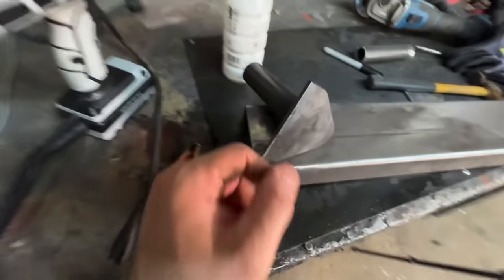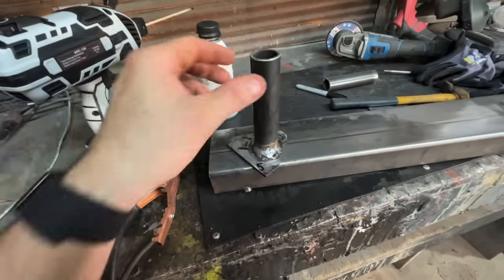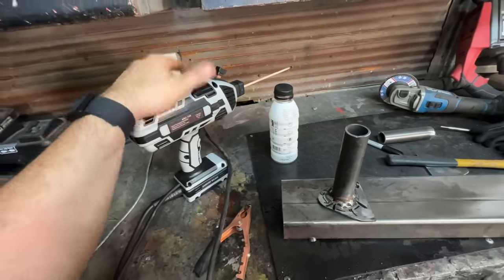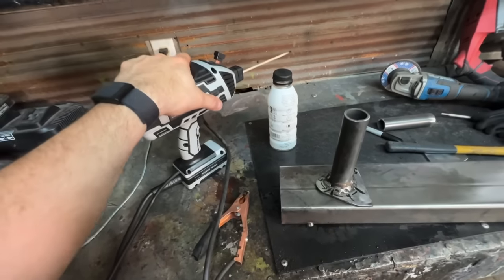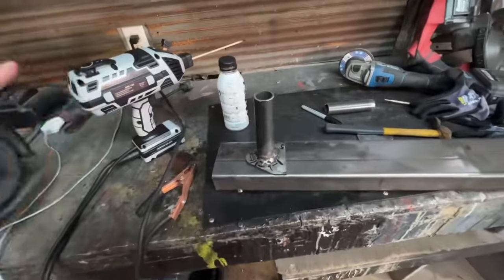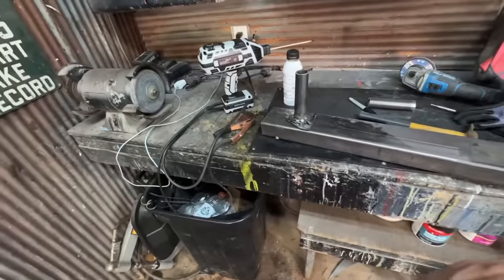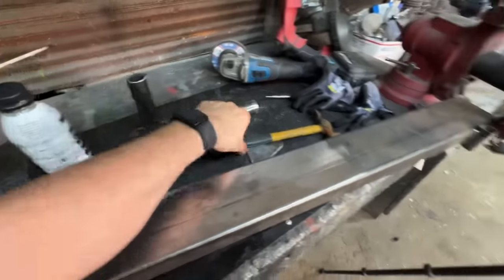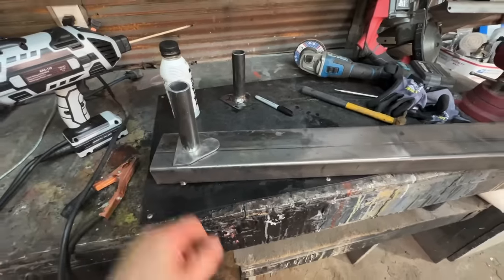That's 100% solid — it's not going anywhere. We also got really good heat. This is 3/16 inch plate — might be quarter inch plate — and you can see we got lots of heat, so it's actually penetrating and doing the job. I've also noticed if you have an extension cord on it, it sometimes seems to run better, which makes no sense. I did some welding with an extension cord the other day and it did better. So when I weld the Mustang bumper I'm going to run an extension cord — there's no reason it should help, because anytime you have an extension cord on a welder it loses voltage.